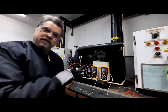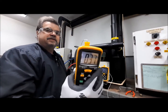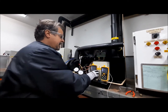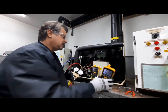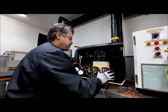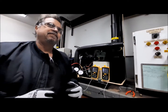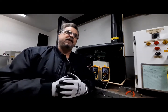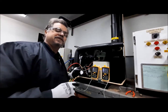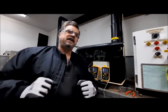What I've got here is a couple of digital thermometers. This one's currently looking at the discharge temperature off the compressor, and this one is basically looking at ambient. So you've got 22 and 33 — that's not too bad. On any given day, a freezer that doesn't use a balanced port TX valve, or its capacity is a bit under, what's going to happen is you might end up increasing your superheat slightly. That will reflect the discharge port temp. When you're dealing with hermetics, putting too much discharge port heat on it is not a good idea.